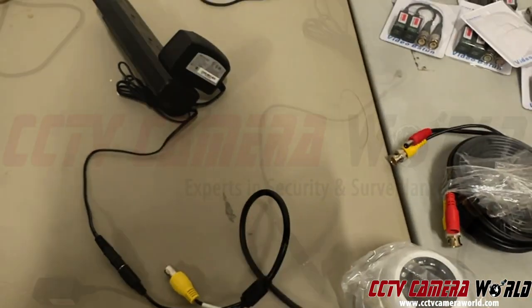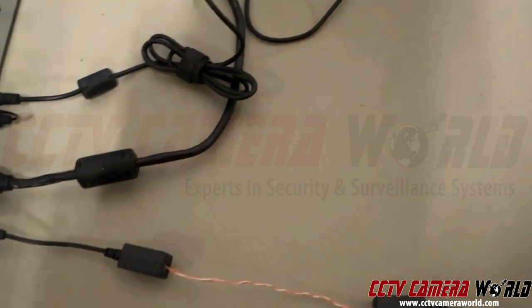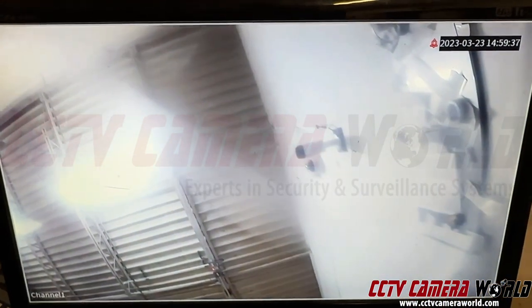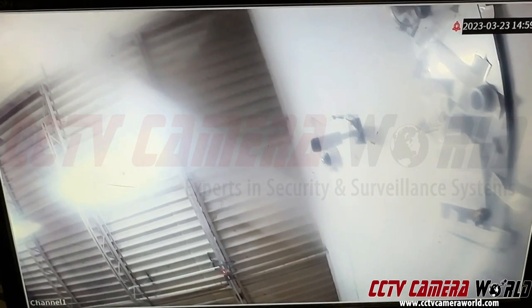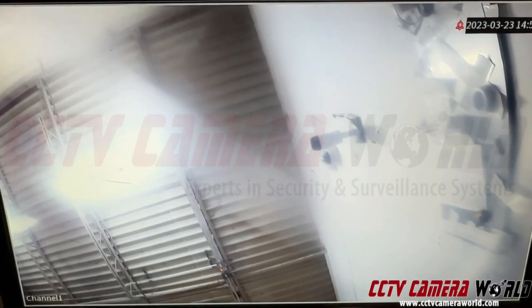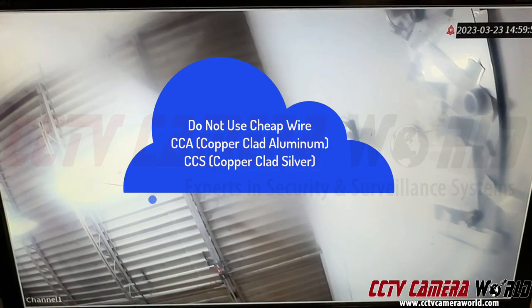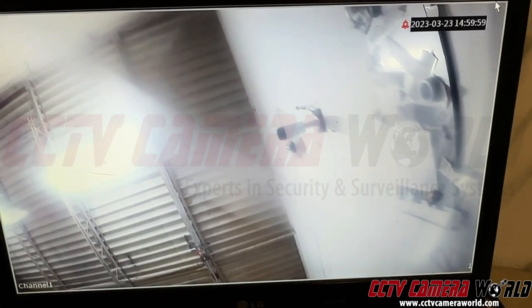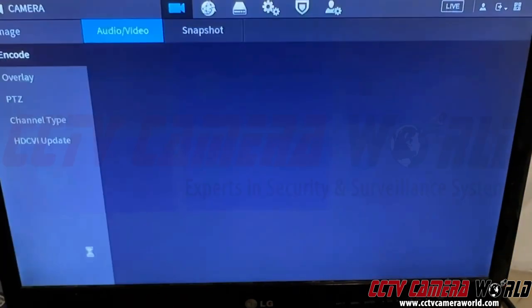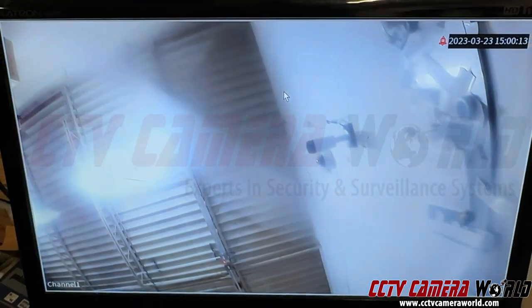Here's what the video balun looks like in a package. The camera is now on screen and you'll see the video is crystal clear — there are no lines. If you're getting lines in your video, your cable is not good quality. You have to use solid copper wire. If you have copper-clad aluminum or cheap wire, you're going to get lines. Also make sure you're using the right type of balun for the resolution you're using. In my case I'm using a 4MP camera, and on channel one it shows up as a 4M — that's a 4MP signal.